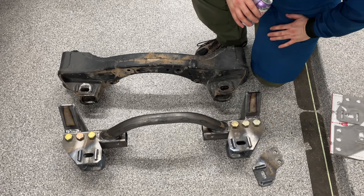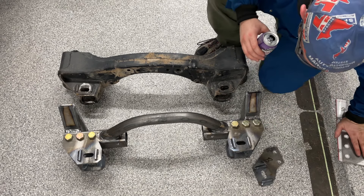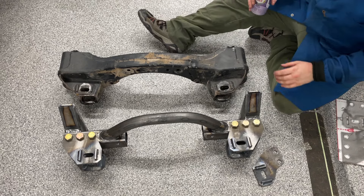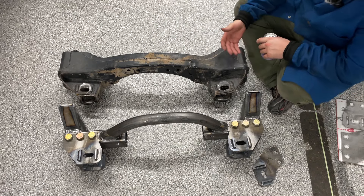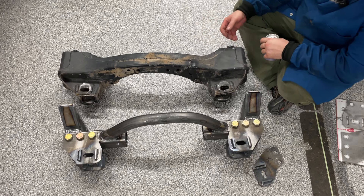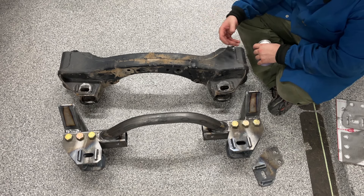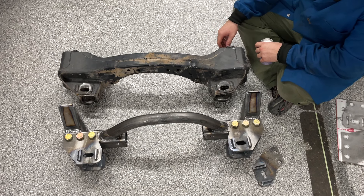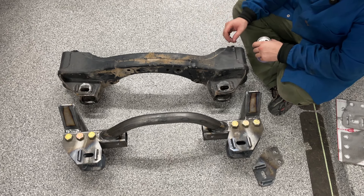This 4130 material is slightly higher — around 70 KSI — but at the same time, 4130 is an alloy that is very weldable, but it's hard to weld. What I mean by that is it is an alloy with 0.3% carbon, that is very hardenable. You weld on it, it gets hard.